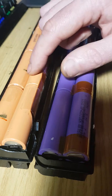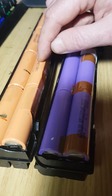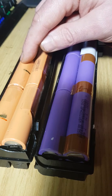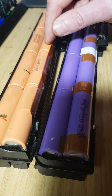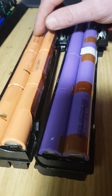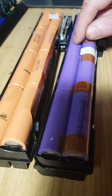And as soon as the circuit detects it hits the voltage that it wants to transfer into constant voltage charging, for instance, these cells are 4.3. So once this hits 4.3, this circuit turns from constant current into constant voltage charging. And then, on the curve, it constantly charges these at 4.3 volts for the remainder of the charge, which is effectively, that end piece is referred to as the float charge, which finally replenishes the complete energy inside these cells. If you did 4.3 with these 4.2s, you run the risk of these exploding.